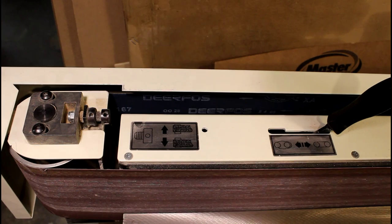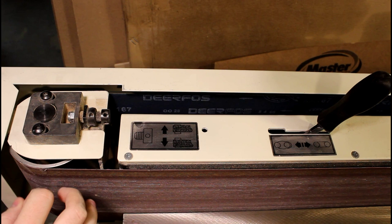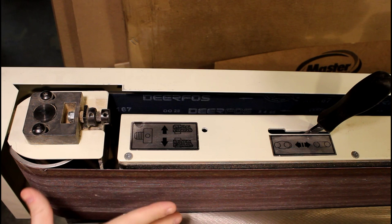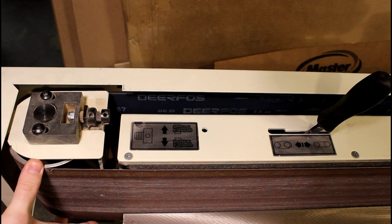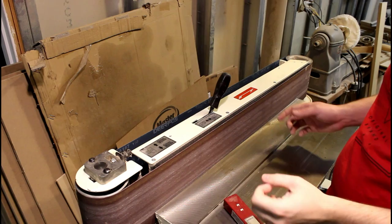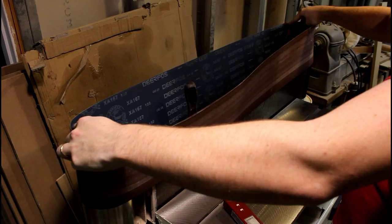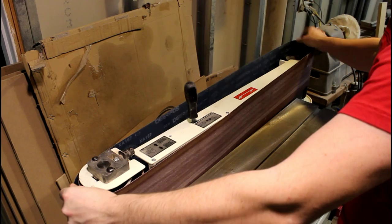The belt adjustments are done on the top of the machine. There's a release lever where you can take the tension off when you want to change the belt, and there are also adjustments for tracking, allowing you to make really precise, minute changes to the position of the belt as it rides on the drum. You'll notice when you put new belts on that they're going to ride too high or too low, and you need to get them centered on the drums so you can evenly wear them and they don't rub against surrounding parts. One of the drawbacks I see on this machine is changing belts — it's a little bit cumbersome. It's not terrible but it really could be improved. The problem is mostly around reinstalling the guard cover.